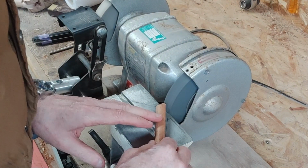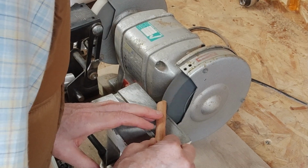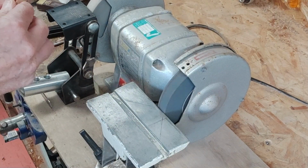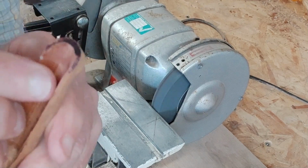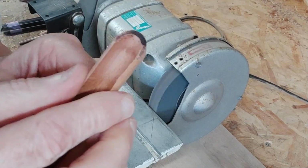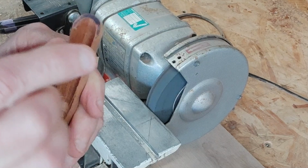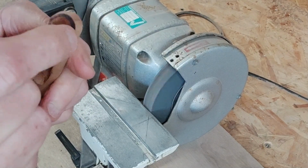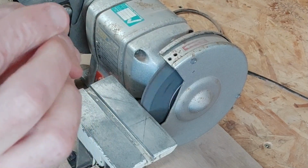You see the mark there? And then what we created was that horseshoe. By putting it on the grinder, obviously it's not designed for wood, but this is just a mock-up using a wood profile. And it created a horseshoe on there. So then, it was a matter of grinding that round so that that horseshoe thickness went to a cutting edge. So it created a guide for us, a contour for us to follow with the bevel.